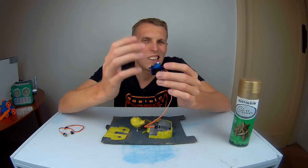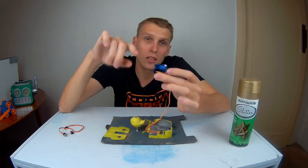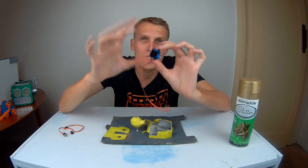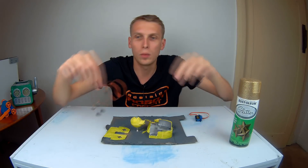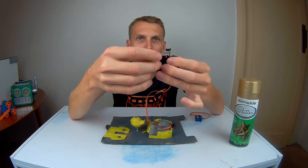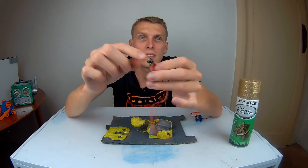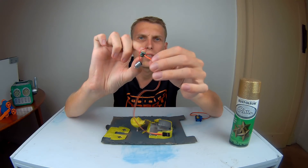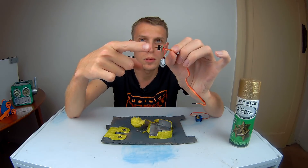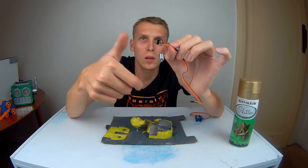These things are okay, but they don't have a lot of power, and the reason is the components. If you take one of these things apart and get rid of all the plastic gears and the plastic casing, you end up with this — a tiny little motor, a potentiometer, and a very small little control board. This control board reads the position of the potentiometer and outputs the correct signal to the motor to get the servo to spin one way or the other.